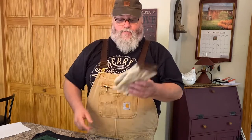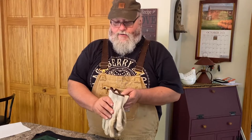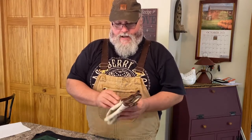Even if you're just wearing a baseball cap, steel-toed boots and a good pair of gloves are important. I suggest real leather gloves — these actually have a Kevlar lining in them. I don't think there's enough there to stop a saw, but it would probably slow it down. I kind of err on the side of caution. If you're not going to use earmuffs, I strongly recommend using earplugs, because a chainsaw will damage your hearing. Especially once you get into the 40 or 50 cc range, you're really going to want something to cut down on the noise.